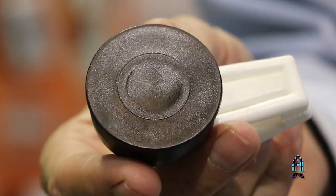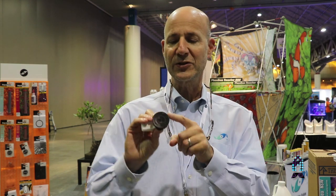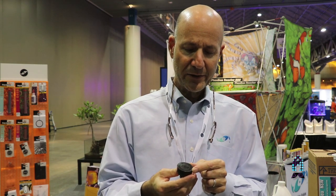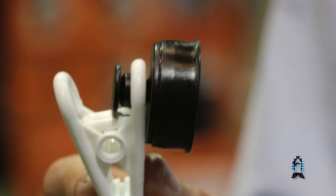Meanwhile, I was working very hard to come up with a way to seal the magnet in there in a practical way that would absolutely never break. We finally have come up with a design where it's all molded, it's one piece, and the seal is inside. These two parts fit together so tight, and there's an O-ring inside — there's no way that they're going to come apart, and there's no way for water to get in there and affect the magnet. So we now have this new design out. That is what it looks like. You see there's no white nor black plastic circle on the bottom that was the original separate piece to seal. It's all one molded piece, and it's bulletproof.